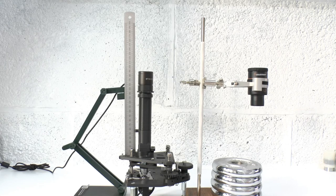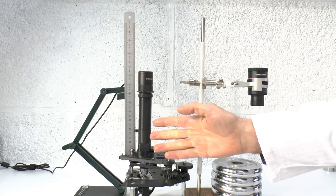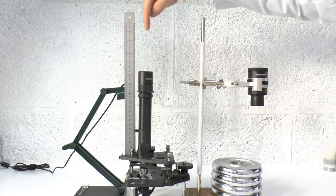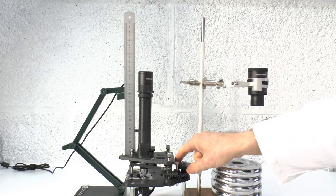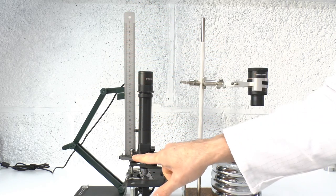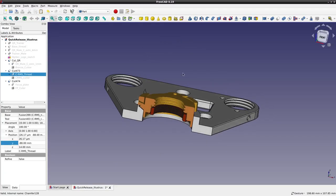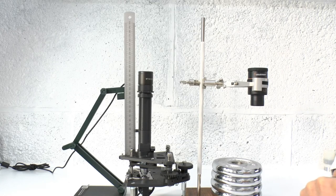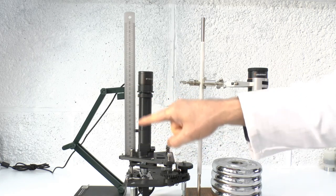For this experiment, we'll start off with the Puma microscope with its monocular head and a standard microscope eyepiece. Using either an eyepiece camera focused at infinity or your eye relaxed and looking into the distance, focus the scope as usual on a specimen. Set up a ruler so we can measure the distance from the focus platform upwards. We know that the level of the focus platform is the same as the level of the flange of the objective, so the optimal focal plane of an RMS standard objective will be 150 millimeters above the level of the top of the focus platform.